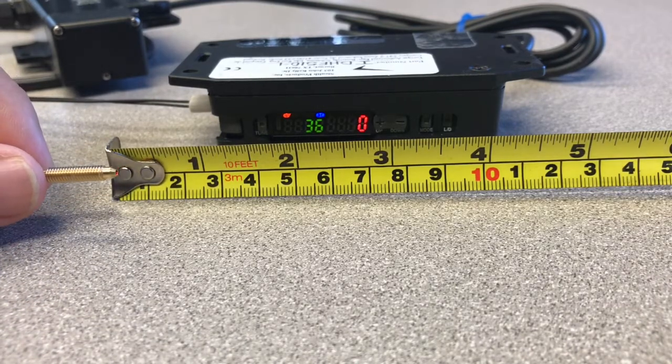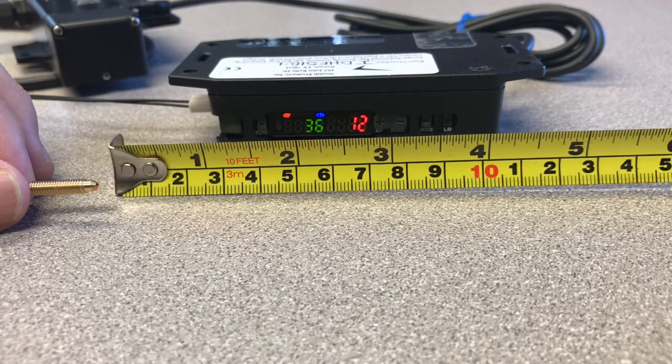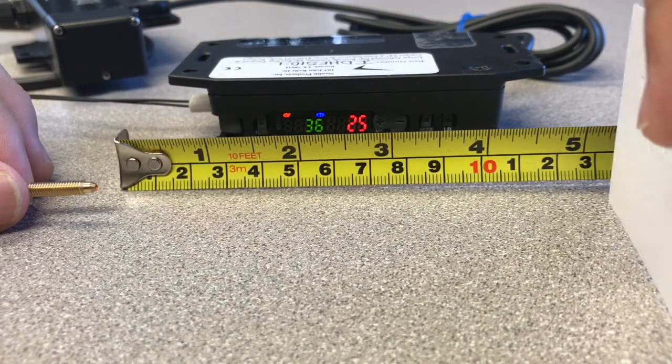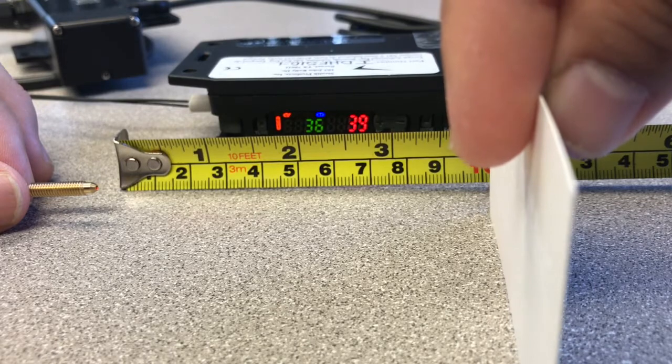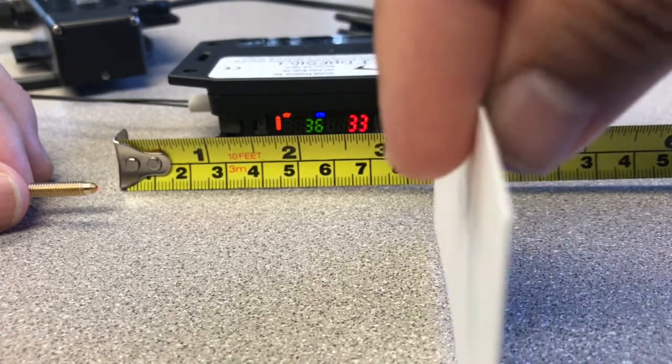One thing I wanted to show here is that I have the business card about 8 inches out, and I'm already starting to get a signal, but it's not an activation, so it's not a clean enough signal. So we're going to try to set up this fiber optic to where it's going to receive clean signals, because it's reflective. It's looking for a reflective type of signal, and you'll see that once we get to about 3 to 4 inches is where you're going to start to get clean activation. So the closer, the stronger the signal.